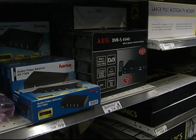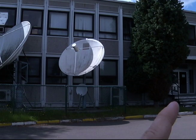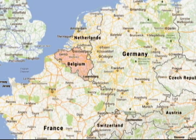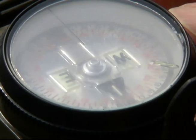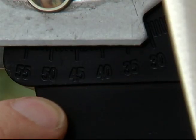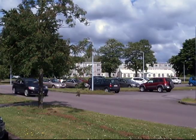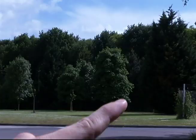Before you purchase the equipment, check to make sure you can mount the satellite dish in a location that will allow you to receive the satellite signal. In the regions of Germany, Benelux, and Italy, this means a clear view of the sky at 170 to 180 degrees azimuth and an elevation of 30 degrees. The view must be unobstructed because the satellite signal will not go through buildings or trees.